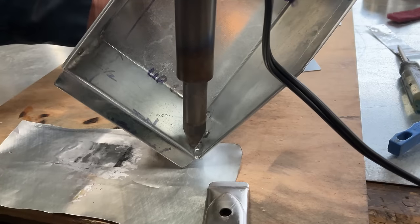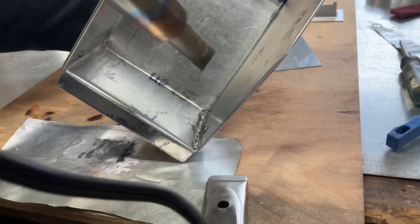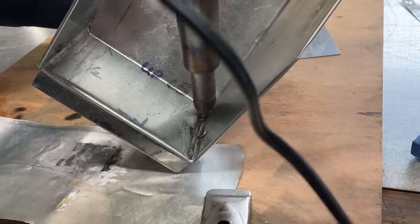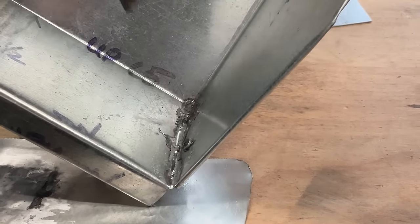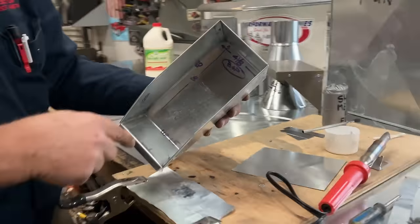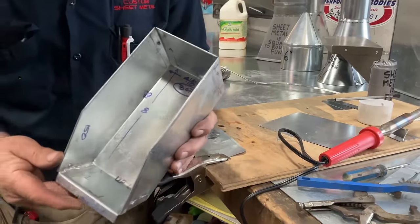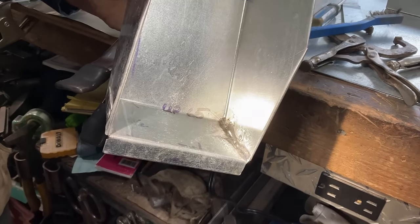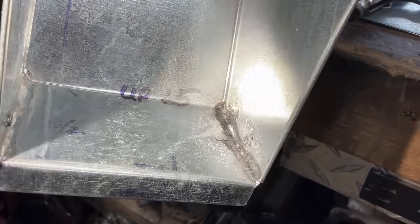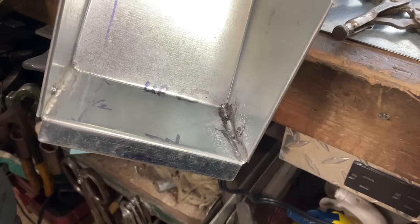Look, I'm actually tilting the box, the organizer bin. One little spot there. Oh, that was that. What you just heard was the water drop. I put water on the inside there. So what it did is it just ran down and got into our project. So you can see a couple of places where it didn't go well because the water ran down and sealed and cooled the solder before it had a chance to flow out like we want it to.